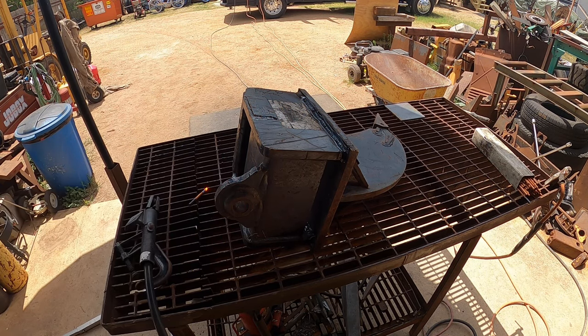We had success. So I didn't gouge in there too much, right? Same with the parent metal, I did a little bit, but it's not going to hurt anything. And the same here, it fell right off, so you can still see the parent metal edge. Clean it up to where there's a slight bevel, and there you've got a bevel for penetration for the next weld. So good.